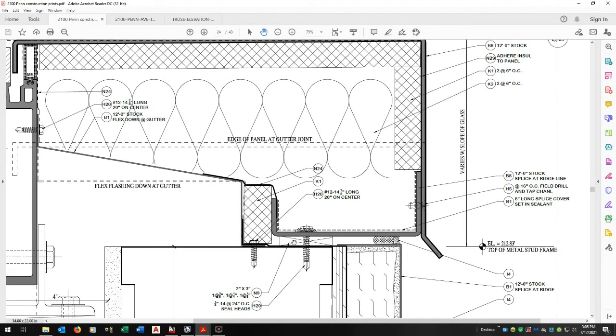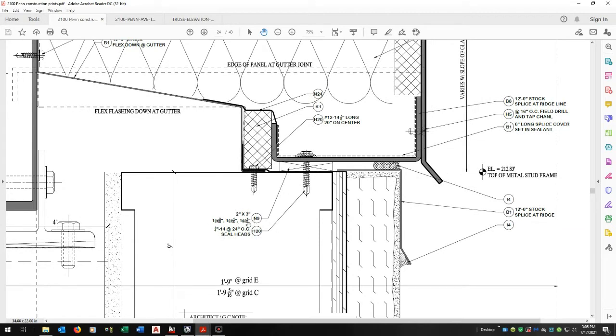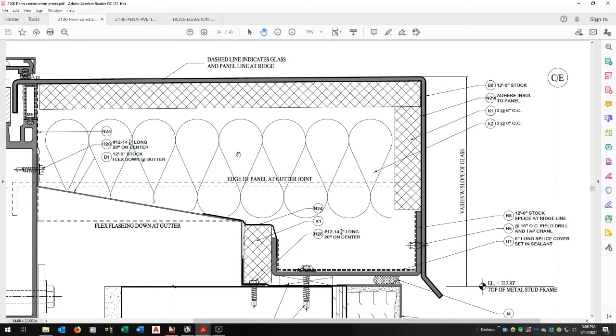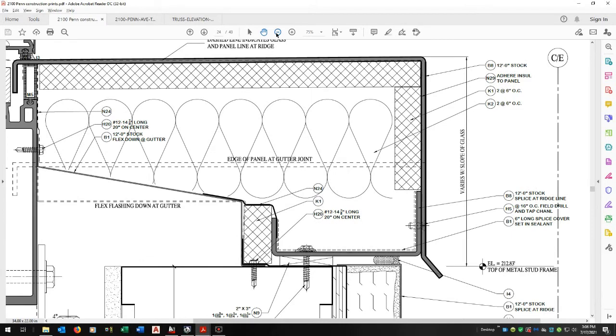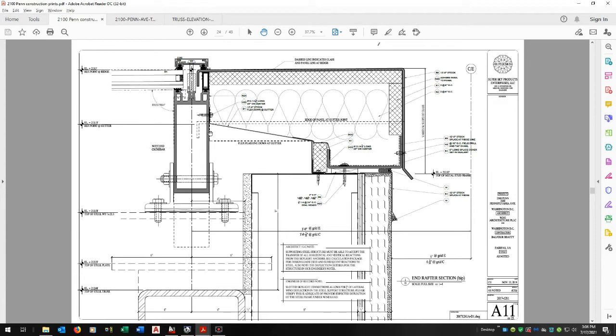You're going to anchor it here through these — seal up the screws good. You've got shims of different heights and then screws every 24 inches. You're going to caulk underneath here after you put this flashing in. Then this panel is going to go last — you're going to drill and tap the channel, but you have the countersinks for reference as to where to put them. That's the basic idea of the perimeter: coordinate the studs, flex the flashing, tape the joints after you have the track in, and then put the panels over the outside.